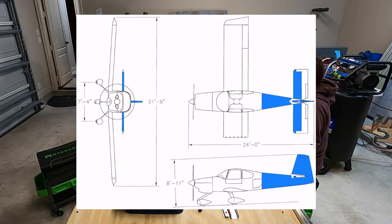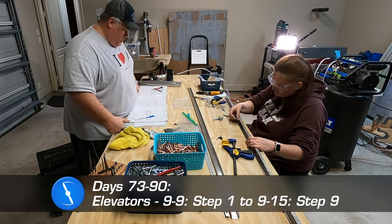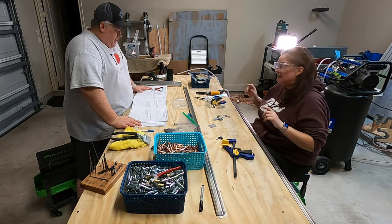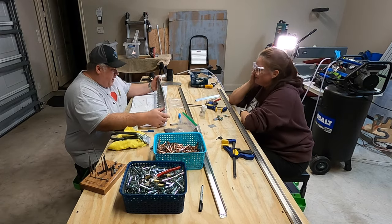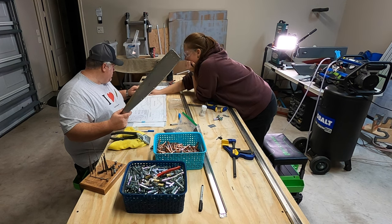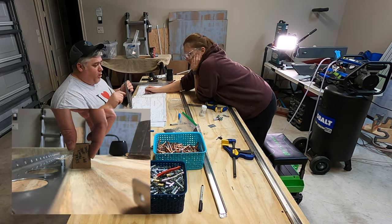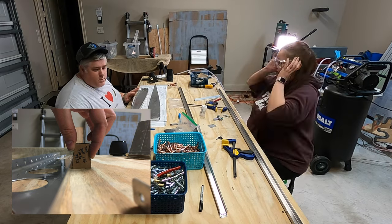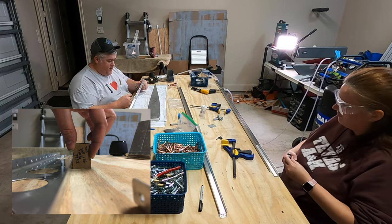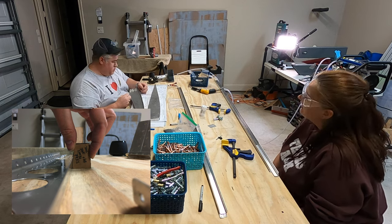We are back at it with the elevators and kicking off on 9-9 Step 1. After you have dimpled the flanges of the spars, it tells you that it could cause the flanges to bend slightly, and to check the angles of them so that it's gonna work out nicely when you got those skins attached. I just used a little piece of cardboard and a little protractor and marked off the angles and tried to use that cut as precisely as I could to test the angle.